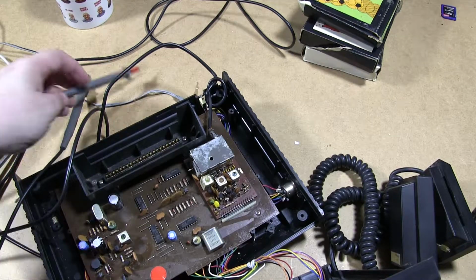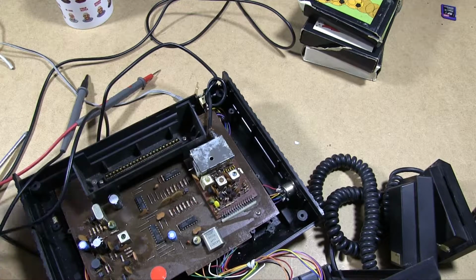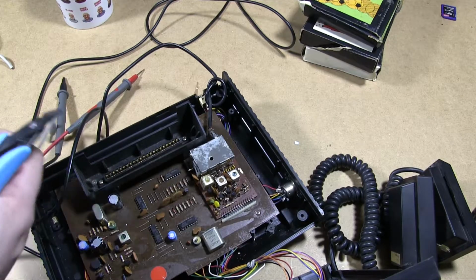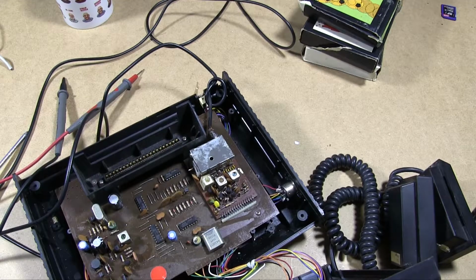You know what? There's one absolutely surefire way of checking, and it's a slightly destructive way, which we try not to do, but I don't really care. This power supply is not going to be used, so it's fine. We're just going to cut the power supply off and work out which is which. We can always splice it back on if we need to, but I would not trust that power supply anyway, so it's fine. So let's strip these ends.